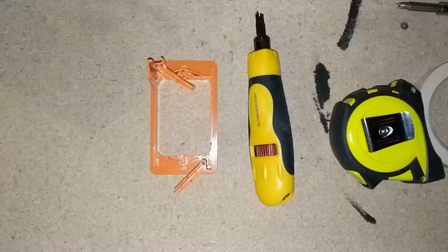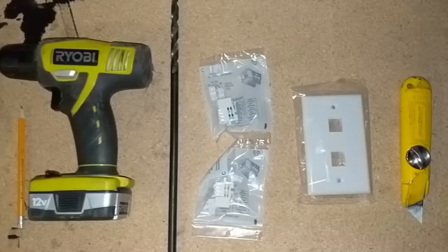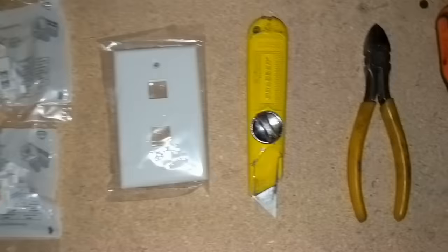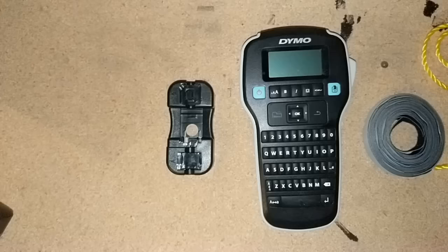Let's quickly go over some of the things you'll need: a low voltage box for the wall, a punch down tool, tape measure, tape, pencil to mark the wall, drill, drill bits (longer ones are sometimes helpful), ethernet keystones — one for each jack you want — a keystone wall plate with the appropriate number of spots, a utility knife, wire cutters, a screwdriver, your bare ethernet cables for your run (measure how long you'll need), and a patch cable or two to finalize your connections.